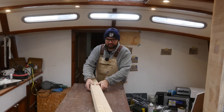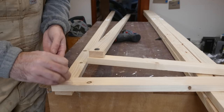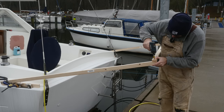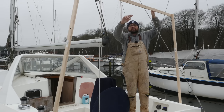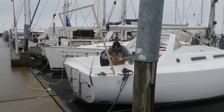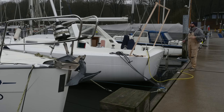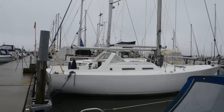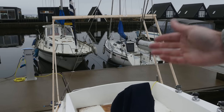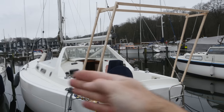The cheapest of cheap wood — this wood is so cheap it's likely to start melting if we see any kind of sunshine. I've attached a thin line to the wooden contraption here, meaning now I can slide it out to see how much tilt I want. This is around 105 degrees relative to the deck. This is at 111 degrees — I think this looks better. It's hard to tell with this pesky piling here in the middle, but I think this could be a winner. I've added the second part of the arch and from here it looks pretty good, but seen from astern I think it's very clear that this should be shorter so that it more matches the curvature of the hull.